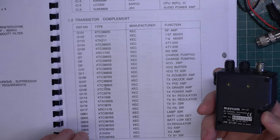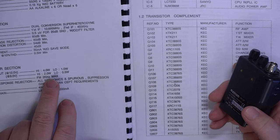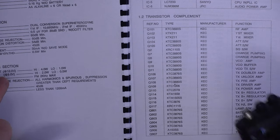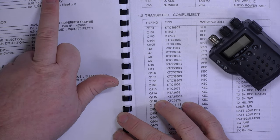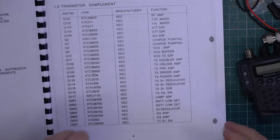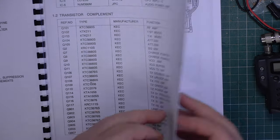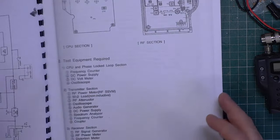It's come with the battery pack and the aerial. I thought it was six batteries, in which case it's nine volts and two watts. Anyway, we're running off the power supply at 12 volts - it does say 12 volts, not 13.8. We can run it up to 15.6, so 13.8 is fine. The fault is intermittent transmit - probably simply the PTT switch. But I'm not going to just say I've fixed it without actually servicing it.